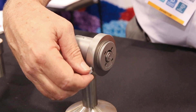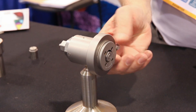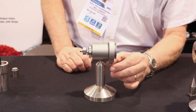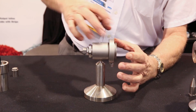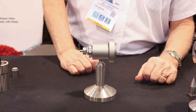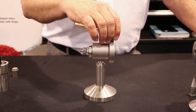The second unique aspect is the center point, or single point concentricity adjustment. This is basically a single concentricity bolt. You have the ability to locate the concentricity adjusting bolt to the location where the flaw is in the wall. Adjust the tension — you don't have to loosen up anything else. Make your adjustments, back it off, and just move downstream from that point forward. One of the unique features of this single point concentricity adjustment is the bolt itself.